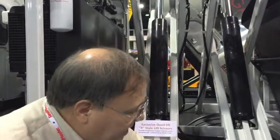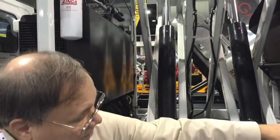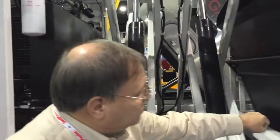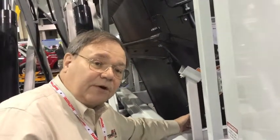In addition to this heavy-duty frame to which all these components are attached, at the rear of the unit, where you have most of your weight hanging off the back, we have an additional 8-inch C-channel that supports this additional weight back here and is connected into our frame. So you've got double protection, double support for the extra weight that hangs off the back of the unit. This is something that's kind of unique for our sweepers.